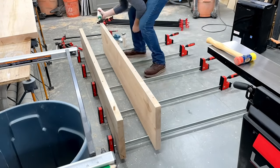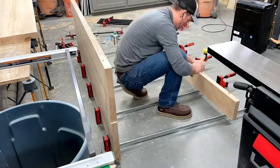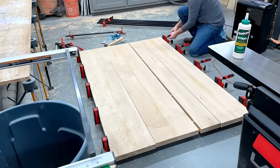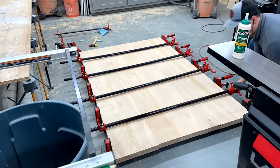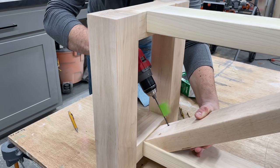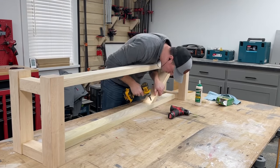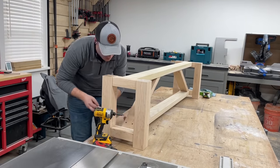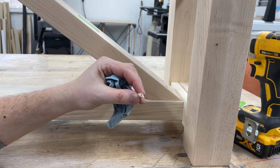I went ahead and got all those groups of two boards glued together to make up the final table top, which is a full 4 foot wide by 6 feet long. And being solid maple, this is one heavy and durable table to say the least. Also worth noting that the grain orientation on every board is opposite from one to the next, and this will help ensure the top stays flat over time. Now back to the bench to add in the angled details — no need to complicate things, these are just glued and screwed on with the holes filled afterwards. If you haven't seen this trick, using a straw to remove the glue squeeze out works really great. It will form to fit any angle and the glue just goes inside the straw versus pushing it out and spreading it everywhere.